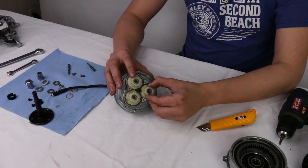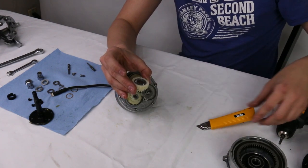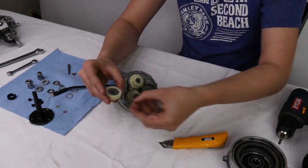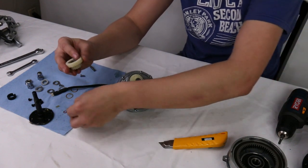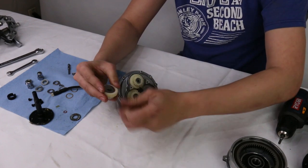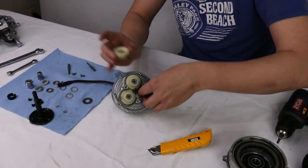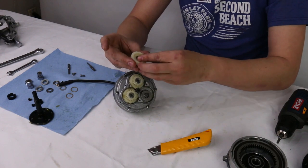As we remove the planet gears, we must be careful not to lose any components underneath. First, there's a very small O-ring which we remove and set aside. Then we have parts you might not have seen in gear-reduced motors before: a thrust bearing. These spiral-cut gears produce an axial thrust as they bear the torque from the motor. The thrust washers and the washers they run on must all be reinstalled in the correct sequence: from the planet carrier surface, a single washer, then the thrust bearing itself, then a second washer. The O-ring sits on the inner race of the bearing.